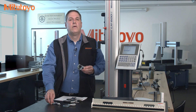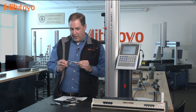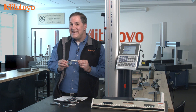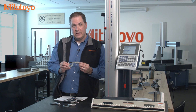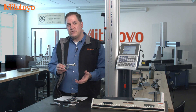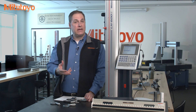With a graduation of a thousandth of an inch, this very common mechanical micrometer has an accuracy of one-tenth of that — one-tenth of the one-thousandth scale graduation on the unit. Now for digital instruments, you can make a general statement that the accuracy can never be smaller than the resolution. You can't measure more accurately than the smallest deviation the instrument can see.